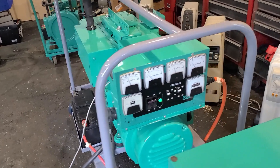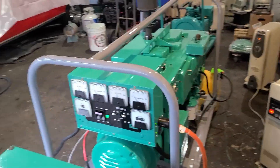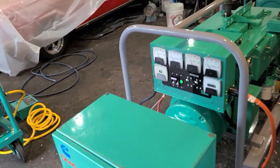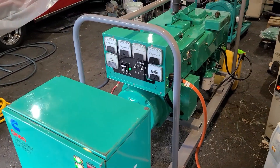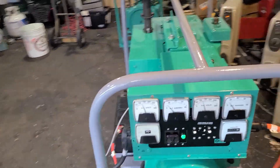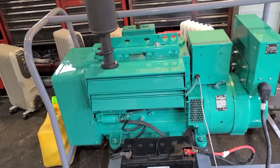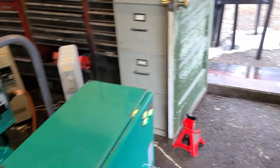I've got a feeling these air duct shutters are pretty important for a diesel — didn't come with it originally. I think these diesels really need to keep their heat and run hard. I hate to do this, but if I take the load off both together and I start wet stacking I'm going to have a mess. So I'm going to turn the grid power back on. The transfer switch is going to wait a few seconds to make sure the power is stabilized on the grid, then it'll shut the diesel down. I don't want to reduce this set with no load and get that crap again.